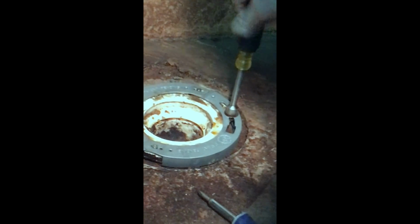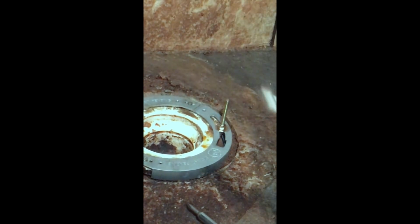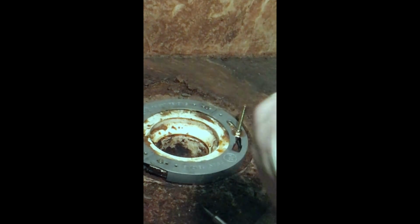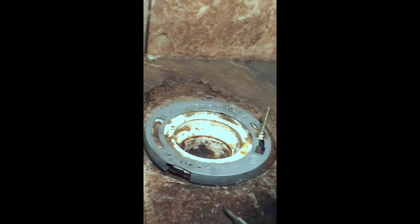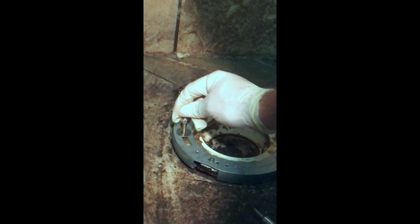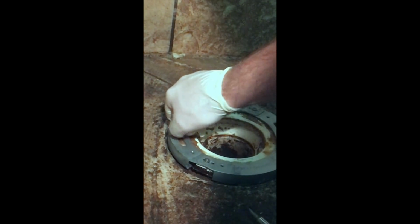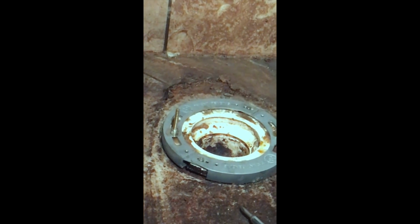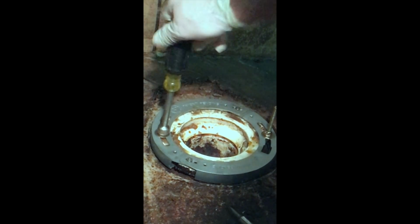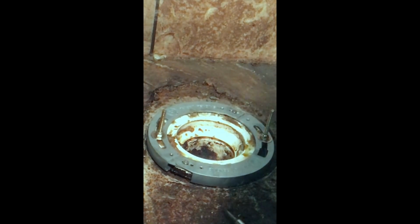Okay, bolt's almost tight. There she goes. She is tight. And we'll do the same with this other guy over here. We'll put him on there, and then you want to get this guy in here, and you want to follow around here. Since this guy still has the old rail in there, we'll just use that old rail for support also. That's why this one's taller than this one, but it doesn't really matter, because as long as we have something to bolt the toilet to when we set it, then we're good.